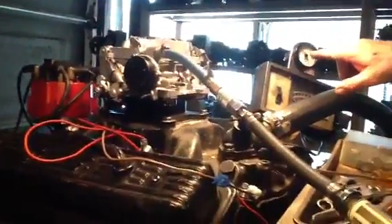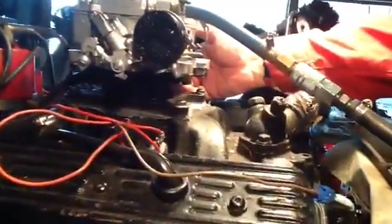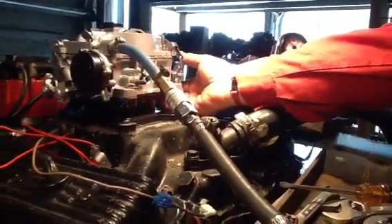We're running about 12 parts of air and one part of gas. We're going to switch it over to a high pressure system and see how the bowls hold up. Here we go to 9 pounds. Look at these things that have a bad bowl system — when you switch them over the motor will die. This here looks like it's pretty good.